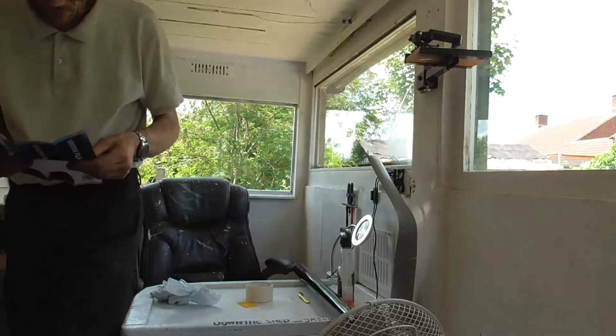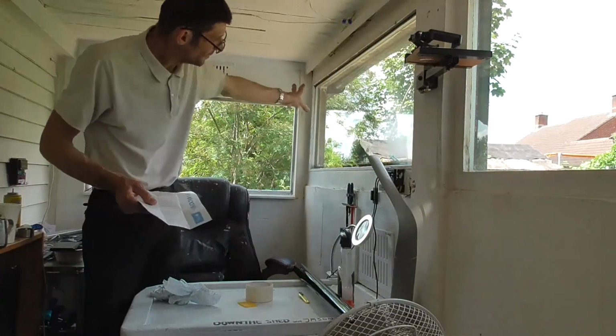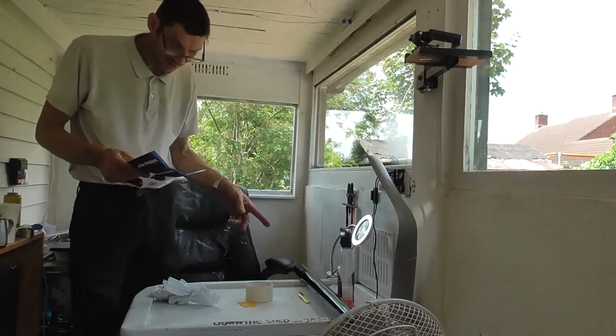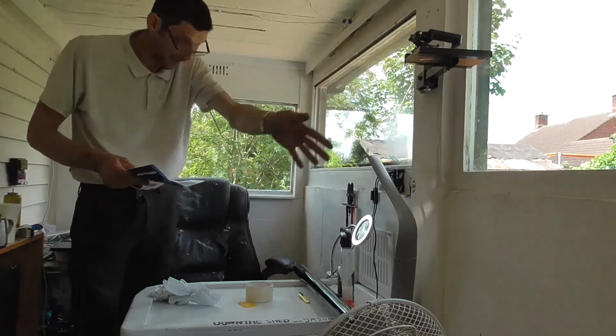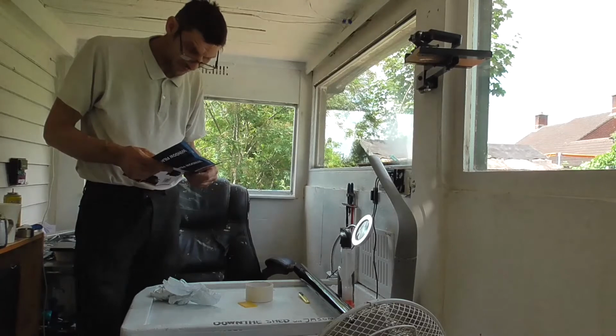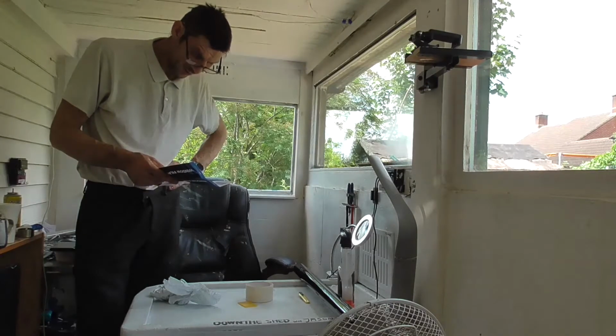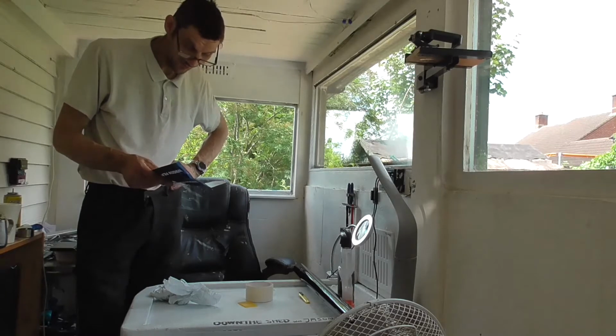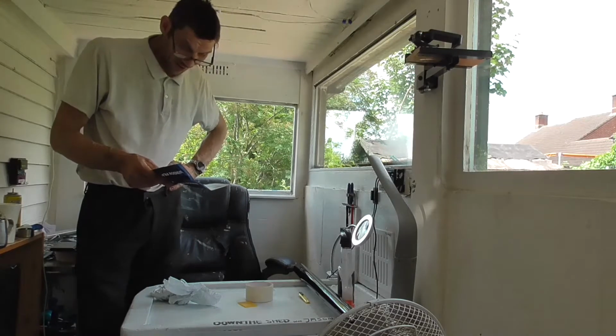So hopefully that might have helped you. We're basically just going to soak this side of the window up. We're going to work out which is the clear protective layer. So we'll cut this to length anyway. Peel the liner off the window film using the same tape method used under film preparation. Use a credit card to help you push film under the window gasket. So there we go, there's the credit card already suggested by them.